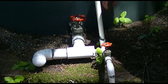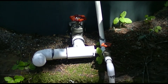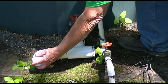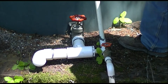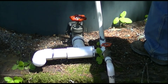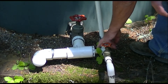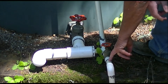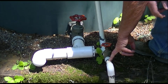Shut this valve off and no water can go through the system or leak out of the tank. It comes down here to a T, so here's a threaded connector with a cap on it, and that is meant for feeding a fire line, which doesn't exist yet. The T comes over and it necks down to three quarters of an inch, and this line goes down and joins the main supply line to the house.